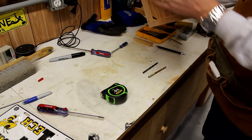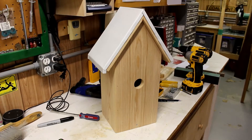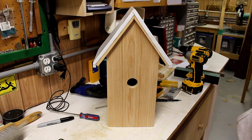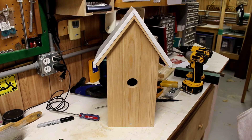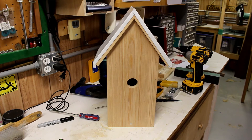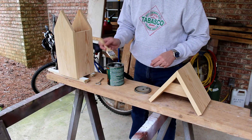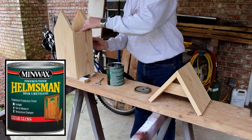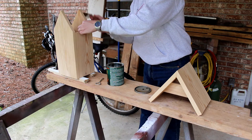It's got a quarter-inch recess, so now I'll sand everything down. I'm going to take this and put on some outdoor urethane varnish on it to protect the wood. Between that and the metal it should do just fine for at least a few years. So we're putting on the spar urethane — that will help seal the wood. I'm brushing it on where I would normally spray, but this is an outdoor project so it really doesn't matter a whole lot.